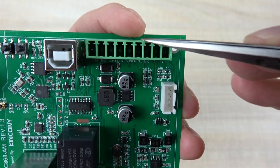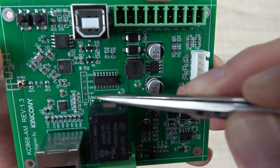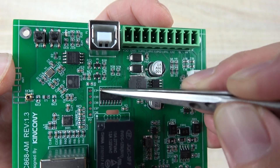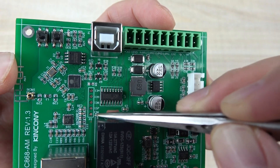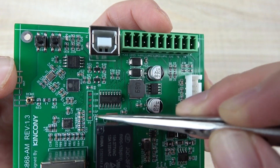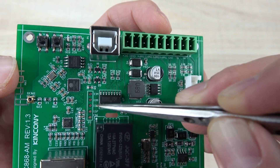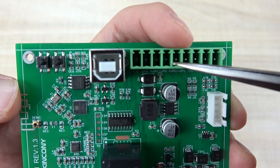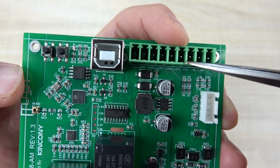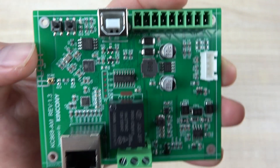So you can also use these GPIOs for your own functions. There are four terminal GPIOs and also five additional free GPIOs you can use. However, these are only used for input signals, such as analog input or digital input — mainly used by the ADC. And the four terminal GPIOs support two-direction communication, so you can use them as input or output.